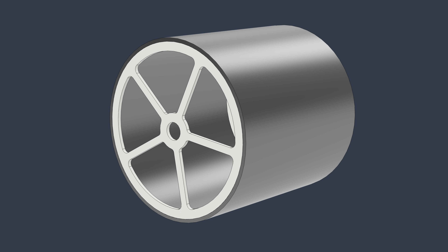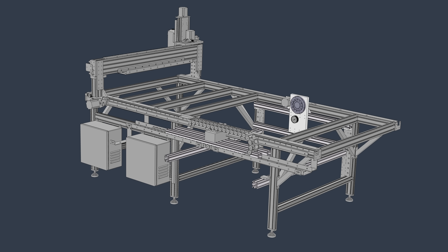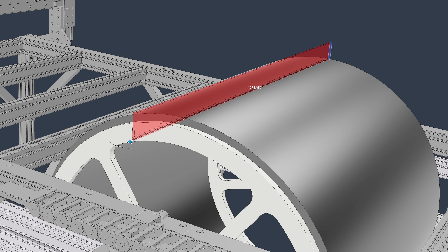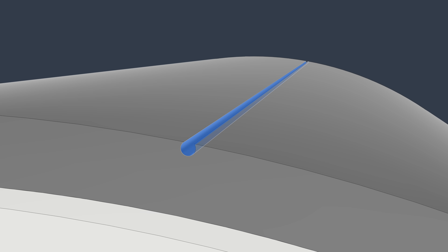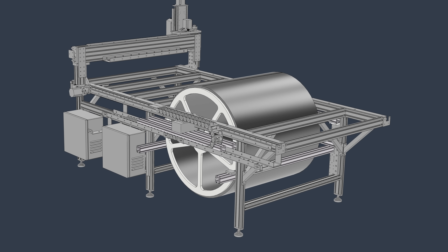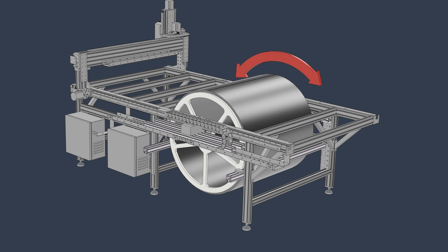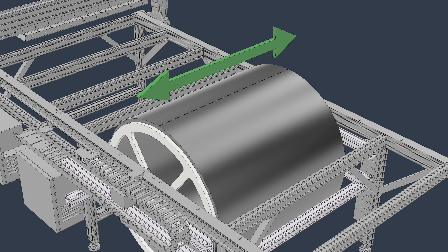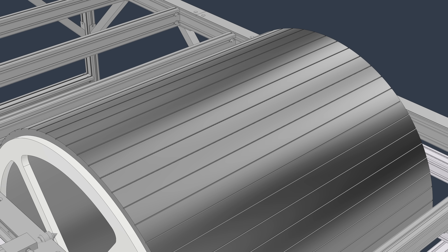Let's look at how exactly we would build version 3. First we build a cylinder structure — and the cool thing is that the inner and outer diameter is not particularly important in this design. We put the cylinder in the rotary CNC machine and then use a ball cutter bit to cut a round slot just a bit below the surface. We can cut the slot along the axis on the rotary machine, which doesn't add pressure in the rotary direction — we add machining pressure in the direction where the rotary machine will be totally stiff. This makes it simpler to machine and simpler to get accurate, and then we can cut the same 64 slots around the entire circle.